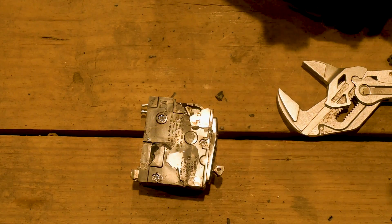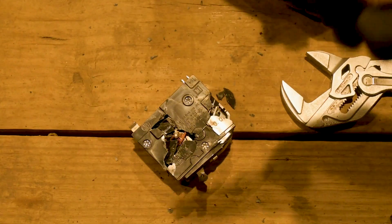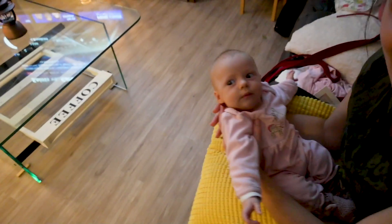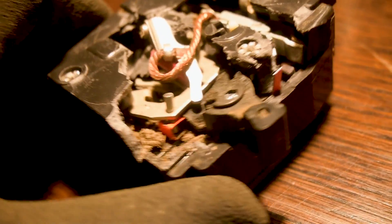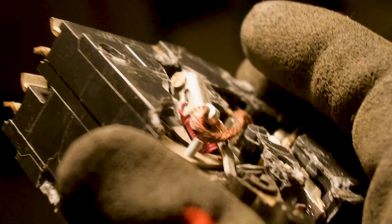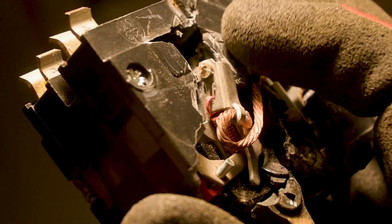Let's open up that bad breaker and see what's going on with that. Oh my goodness. Wow. I totally see what's going on. This is the wildest thing. Look at how damaged it is. It exploded when I turned them on. I'm just kidding — I smashed it with the wrench. But there is something really cool — look in the light. Right here you can see we've got some kind of debris from some insects. Right on the end of that little circle part, see how there's like that dirty stuff? That's what caused us to not be able to turn the power on from the second leg, which is just super interesting. I didn't know that breakers were that susceptible to insects getting into them. So can we like clean it off? We could clean it off and reassemble it — it scrapes off. So in theory, if I hadn't smashed this thing — if this hadn't exploded.